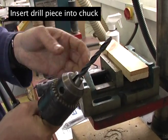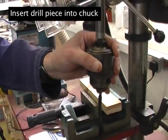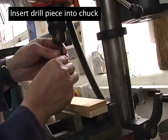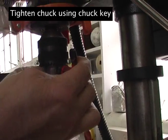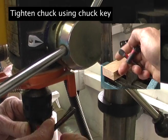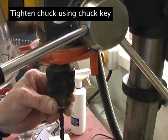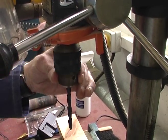It's hard to explain when it's kind of vertical like that, but it's a very tight fit into that drill bit which is acting like that and moving up and down. You actually tighten this chuck up with this key here like this — it's always clockwise. Just finger tight so the drill is actually tight into the machine, and very perpendicular as well. It's got to be absolutely straight.